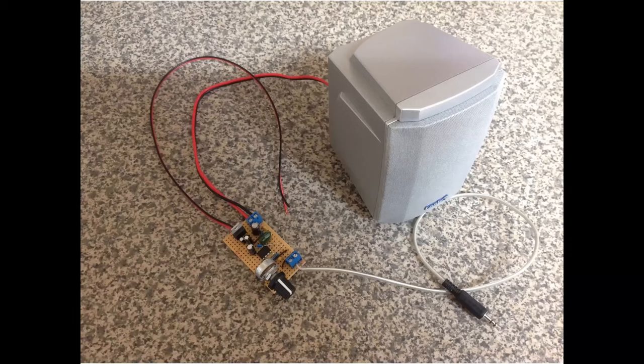Now, actually, funnily enough, every module I've built, this is purely fluky, but it's very fortuitous for our purposes, I've built using a different method of construction because there are different ways that you can scratch build. And this is using strip board. Which for audio is absolutely fine. You wouldn't want to really build anything RF related on it, he says, having built his first analog VFO on it, because all those little strips on the back of it act as capacitors, and if you're trying to have a tuned circuit, it's going whoa all over the shop. But for audio stuff, it's absolutely fine.